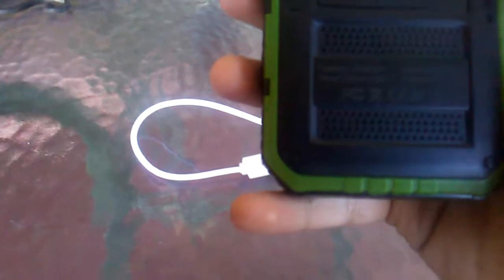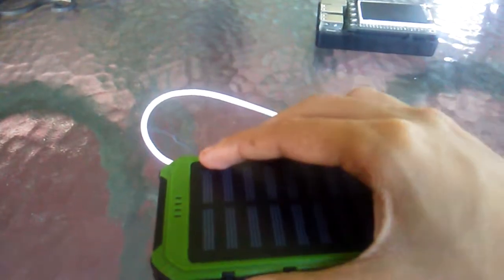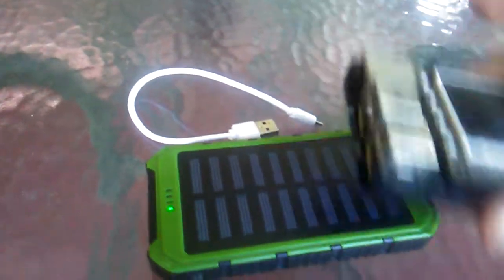Just in case I'll read it to you. The capacity is 12,000 mAh and the input is DC 5V at 1.0A. There are two output ports and one port for charging. One port will provide 2.0A and the other port will provide 1.0A, both at 5V.